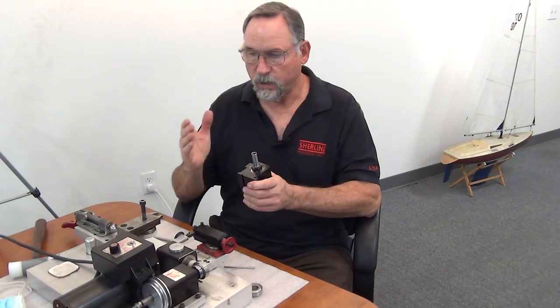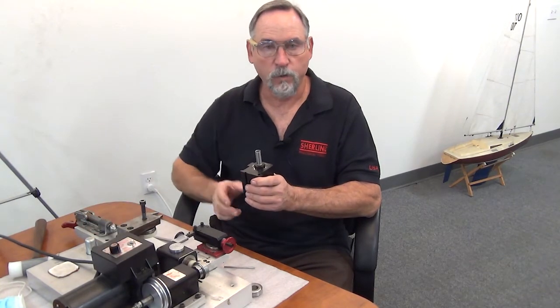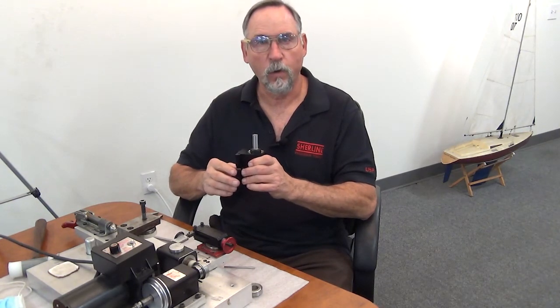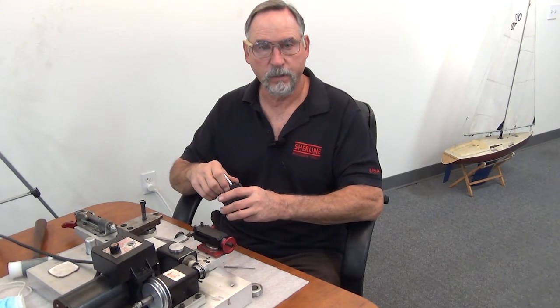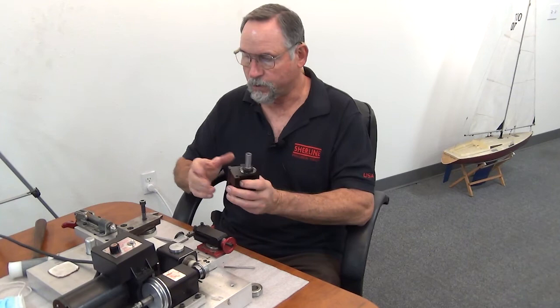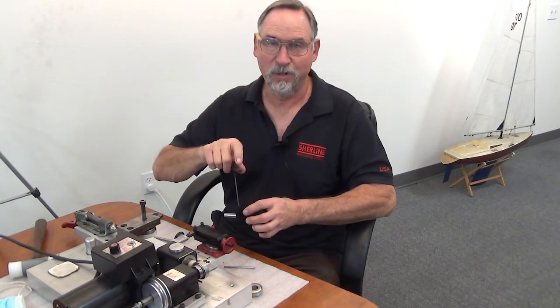What I'd recommend if you go to a 10,000 rpm spindle: leave the original spindle on there first, set it at the high rpm — normally 2,800 — and let it run for 20 minutes. Put your hand on it and see what the headstock temperature feels like. It's going to get warm, but it shouldn't get too hot to touch or uncomfortably warm. Then put your 10,000 rpm spindle setup on after you've adjusted your bearings, turn it up to 10,000 rpms, let it run for 20 minutes, and check the temperature difference. If it's getting hot, you still have too much preload — go through this process and back it off a little bit more. Make sure you tighten your set screw after you set your preload.